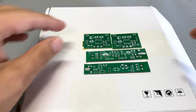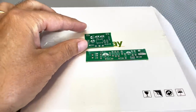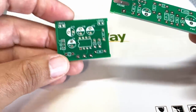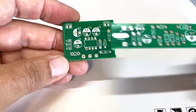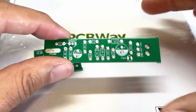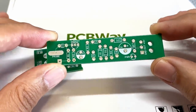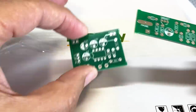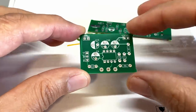For this build I'm not going to use the SMD version and not the second amplifier. I'm only going to build the probe with the through-hole components and then the LM386 amplifier board. The probe is going to be on a probe module or tube — I still have to figure out how to get that done — and the amplifier module will be in some sort of enclosure with a speaker.